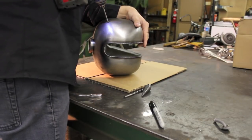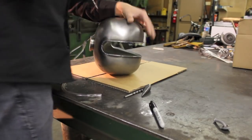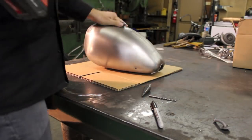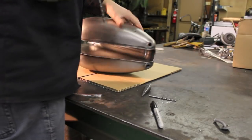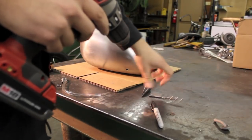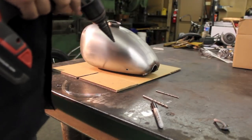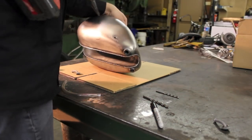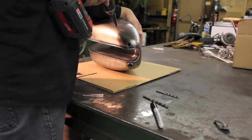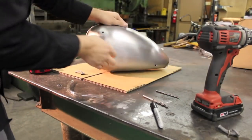The key word there is sharp. Once you have your pilot holes, open them up with a three-sixteenths bit — super easy — and then open further with a step bit. The hole on the fitting is only about a quarter inch, so you don't have to get too crazy. Don't go more than three-eighths of an inch overall. That should be plenty.